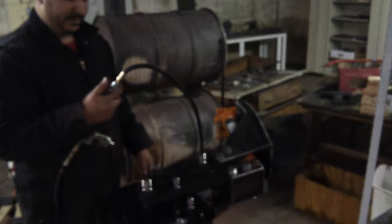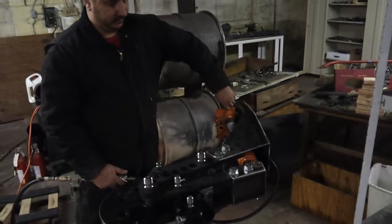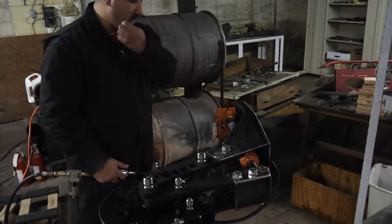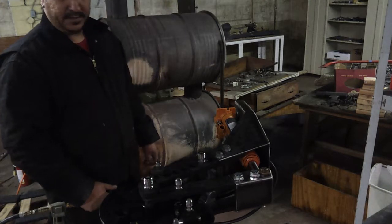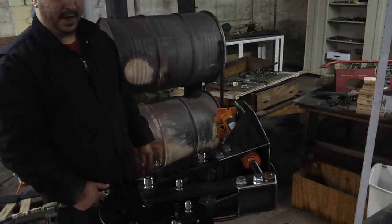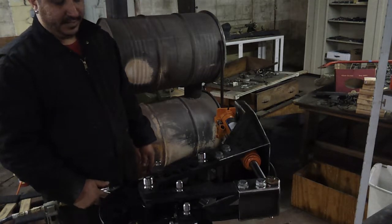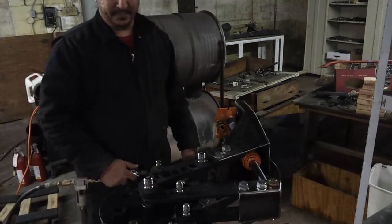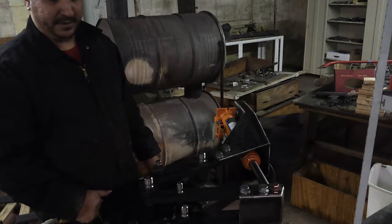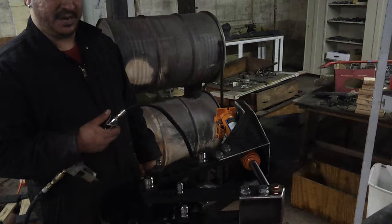So let me get to extending this. You can hear that the ram is slowing down — that's because my compressor is having a hard time keeping up with it. The compressor wasn't completely full when it started but it still struggles. As long as this will bend quarter-inch tubing, I honestly don't care how long it takes. If my compressor can do that, I'm fine. What I'll probably do is do a little bit of a bend and then just wait for the compressor to catch up and start again.